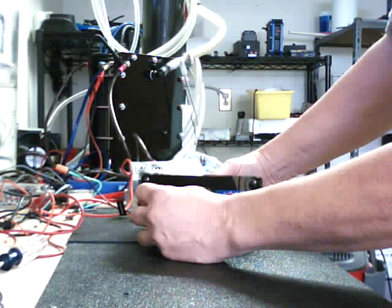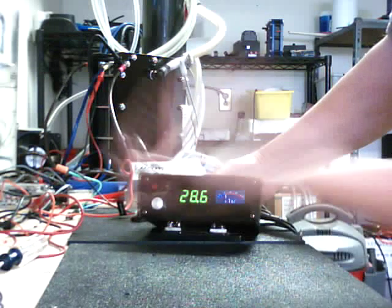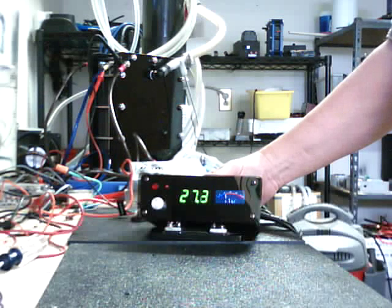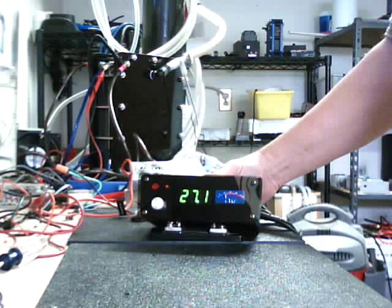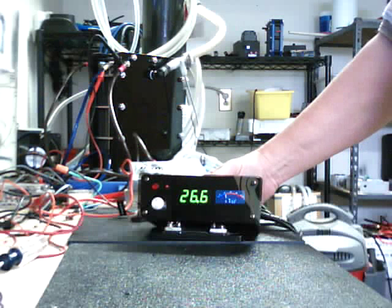Getting 28 amps, 29. What's cool about this is wherever you set your amperage — let's say you set it at 28.4, 28.2, whatever — it's going to actually hold that current there, because like I said this is a current-limiting PWM. And the good thing is it's just plug-and-play. We do have some other features on some of our other controllers where you don't actually control the amperage.